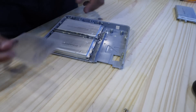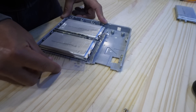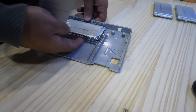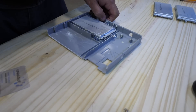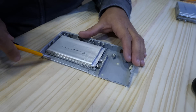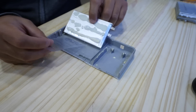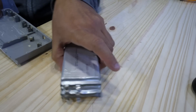To remove these cells you have to use something flat and hard, squeeze it in there, and break the glue. You have to be careful not to bend them too much. You cut these connection pieces so you can slide the tool in there — it's a tedious process. Once I cut those last two pieces, you sneak the tool in, break the glue, lift it up, and there it is — all the cells out.